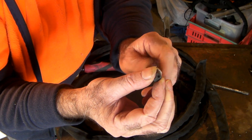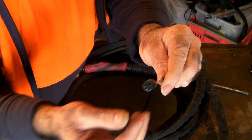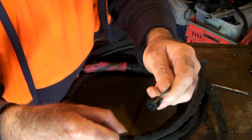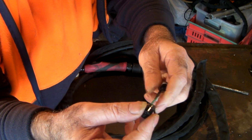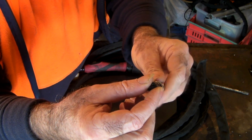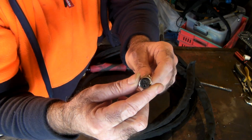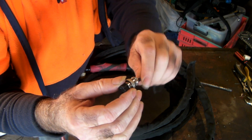If we pull it to bits I'll show you that it doesn't have much holding it together actually. See that guys - it's just got one little bit of solder on that side and a little bit of solder on that side. Sometimes you'll find that when you drag it around your workshop, if you're anything like me and you trip over the thing, you yank that out and then next time you go to use your torch the thing won't go. You think your plasma cutter's buggered, you take it to the shop, they plug in their torch, and then they ring you up and say hey there's nothing wrong with this.